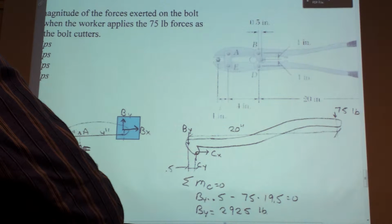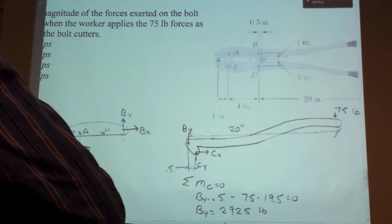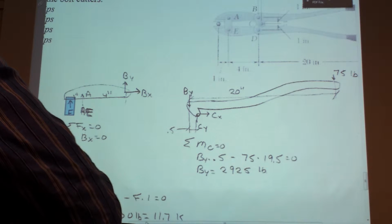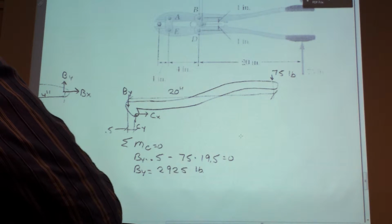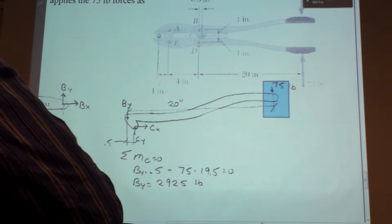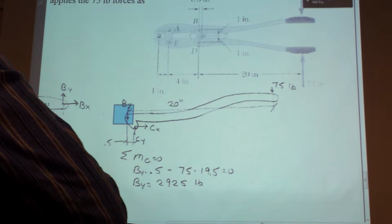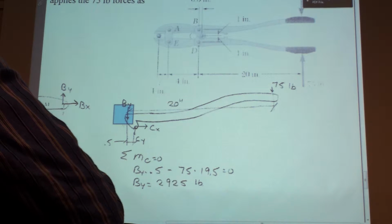There's a two-force member here at A, AE. And then there's where that crushing force, or that cutting force, I guess I should call it, acts. Then my other member here, I'll call this the handle. We've got the force on the handle. Technically, we'd have two unknowns here, Vx and Vy, but we're going to find out real quick over there that Vx is 0, so that's why I only drew one here. And we would have two unknowns here at C.